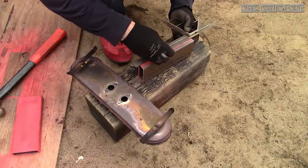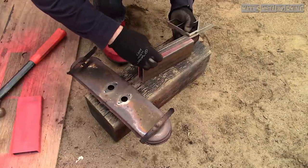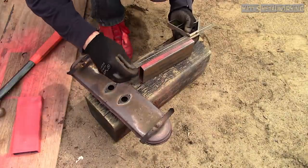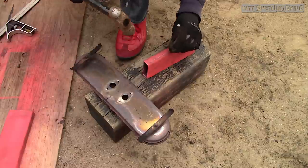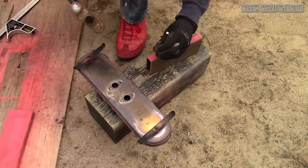There will be two rows of holes. Each row is 3/8 of an inch away from the top and bottom of the tubing, therefore a quarter inch from each other. The holes are spaced a half inch apart and each row is also staggered by a quarter inch. A center punch is used to mark all the holes so the drill doesn't wander and their location will remain fairly accurate.